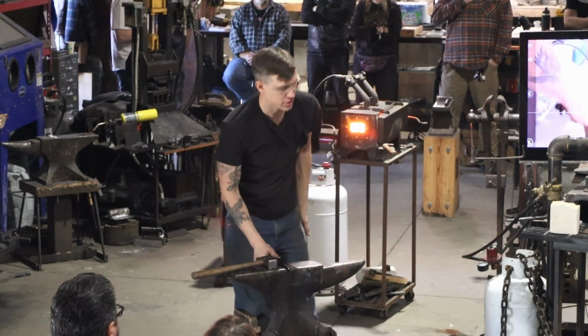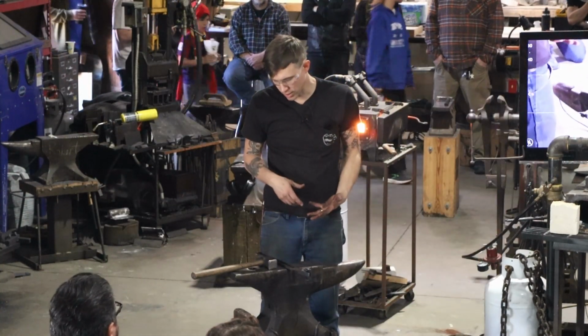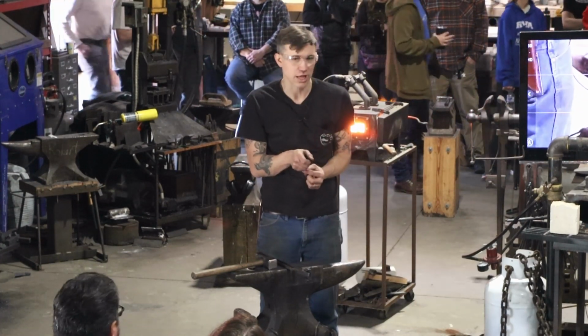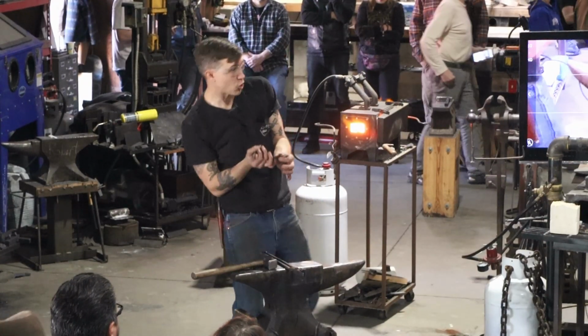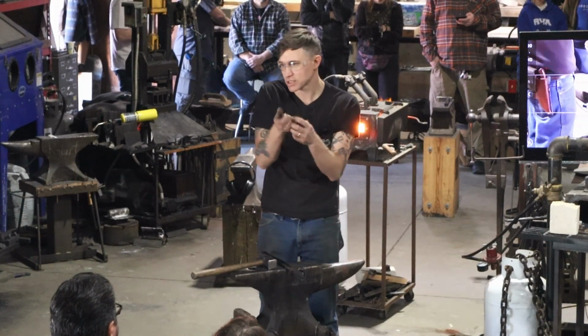I've had some customers who like to rock and wanted it to curve up some, but generally as you come down on the cutting board, you want it to be effective all the way back. You don't want to have some of your cilantro or scallions not quite getting that cut. But some people want a really sharp heel because they'll actually pull that kitchen knife up and use that sharp heel for tiny little paring tasks when they have the big one.